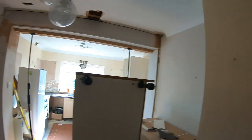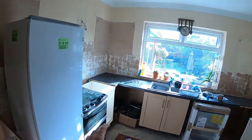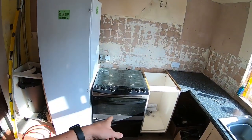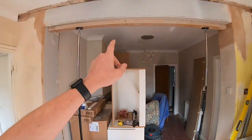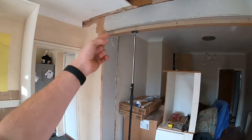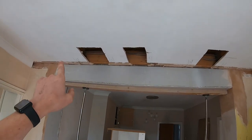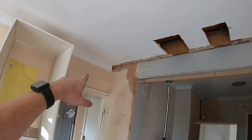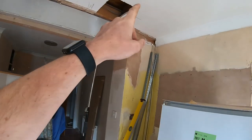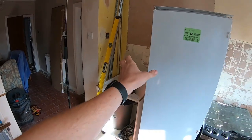So the kitchen is, this wall's just been knocked out. Obviously, a new kitchen's going in here. The old cooker is going, but we need a 6mm feed to here. So what we're going to be doing is drilling straight out into the garage, bringing it across and up. We're allowed to knock a few holes out because a few holes have gone in where the RSJ's gone in. It's a flat roof above. So we're going to get the 6mm feed across, clip it down with this pipework next to it. That's all getting boxed in. So we've got a cooker switch.